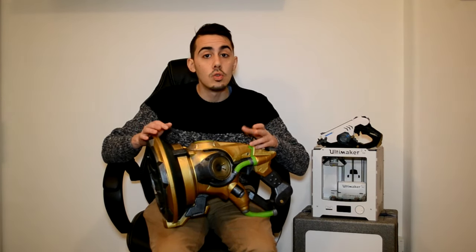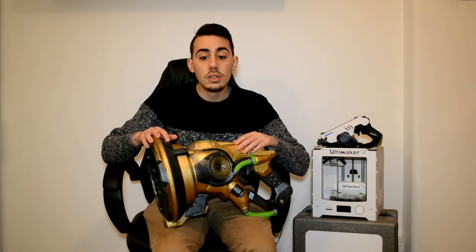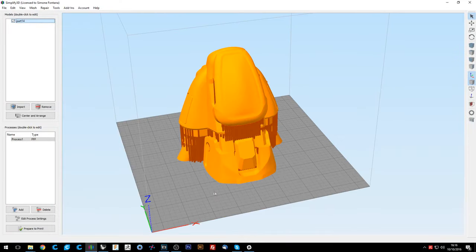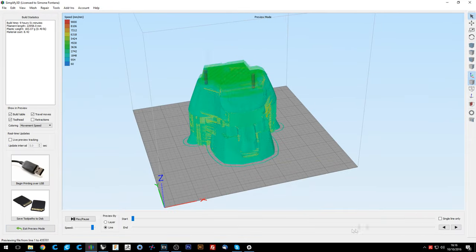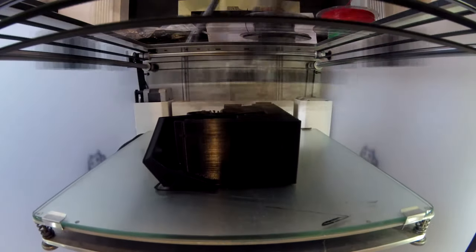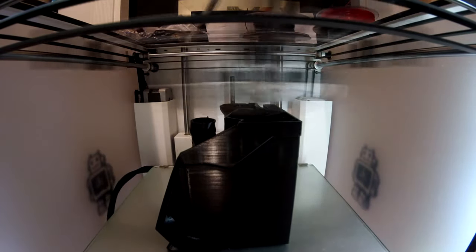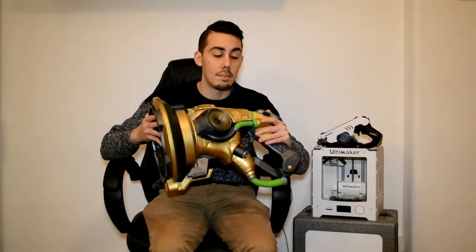I sliced the model to be printed on a desktop 3D printer. For this project I used my Ultimaker 2 Plus with dark grey PLA from FromFutura — if you need filaments I really recommend FromFutura, they provide a 15% discount code you can find in the description. I sliced all my parts using Simplify3D with an average of 7% infill and a layer height of 0.25mm. The print time depends on your settings but I would say it's around 80 to 100 hours because it's quite a big model.